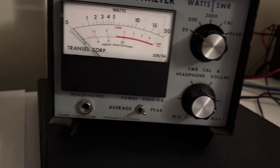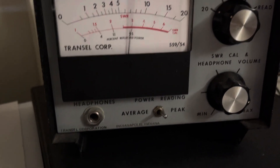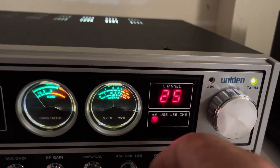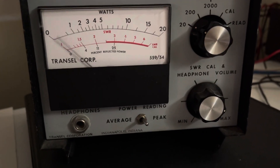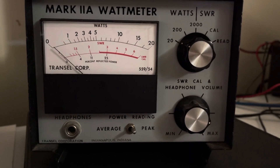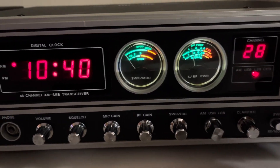So like I said, it's all stock power. On the 20-watt scale, AM dead key is at 4 watts, and audio swinging 10 to 12 watts. Flipping it over to sideband — audio swinging almost 20 watts on sideband. Again, there are no limiters clipped. You could clip the limiters and get 15 to 20 watts of swing on AM, but you don't really need it — it's not going to make a noticeable difference.